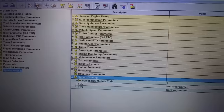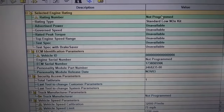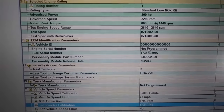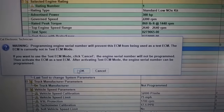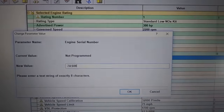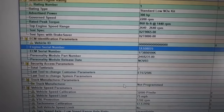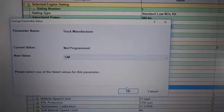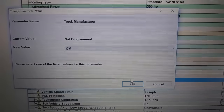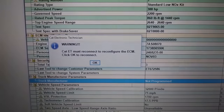These are your FLS and FTS — we're going to be going through the entire parameters here, just the important ones. First, at the very top once we expand it all, is your rating number — most are just going to have one rating number, select that. Next is going to be our engine serial number — this is very important, obviously you want to get this correct. Once you program an engine serial number, you can't put it in test mode — don't worry about that, just put the right serial number in. Then we're going to move on to truck manufacturer — you can see it needs to be programmed. There's usually only two settings: GM or Other. If it's a Freightliner or anything else put it to Other — this is an RV with a Freightliner chassis so we're going to set it to Other.